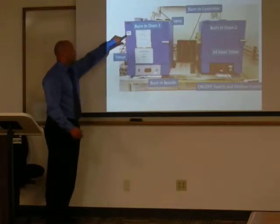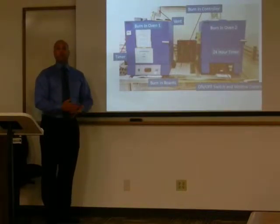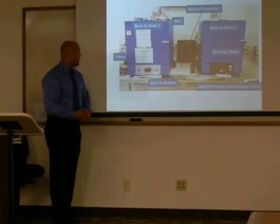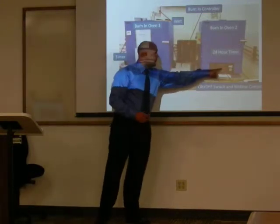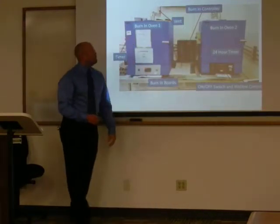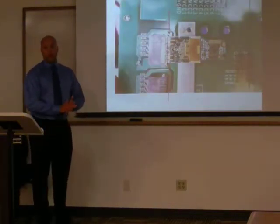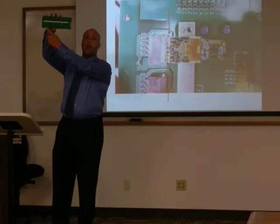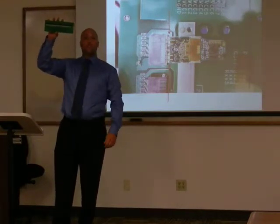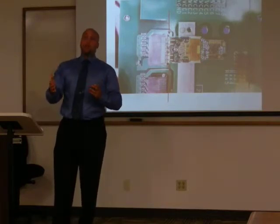So you see this timer up here, you set it for 15 minutes, which is the time it takes for it to ramp from room temperature or ambient temperature to the 100 degrees. This buzzer will alarm, indicating it's time to start both this timer and that timer. Before you can start the burn-in process, you need the burn-in boards. There's 8 slots, and there's 6 of these boards for each part of the controllers. An A controller and a B controller.